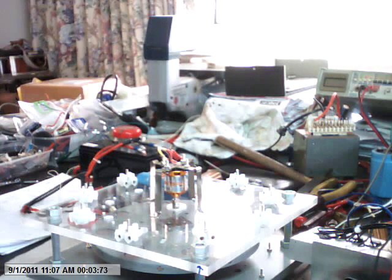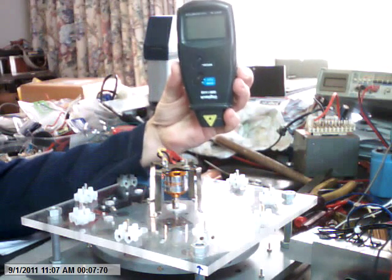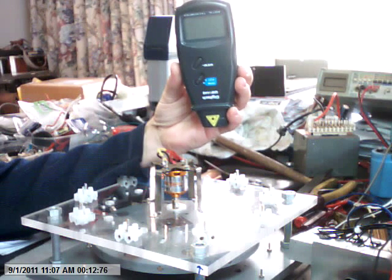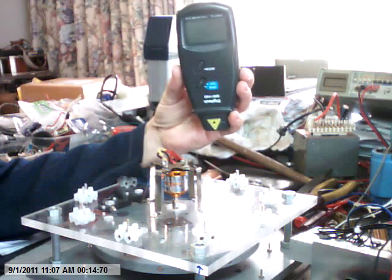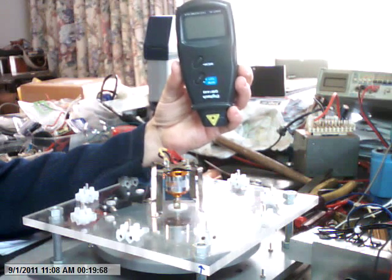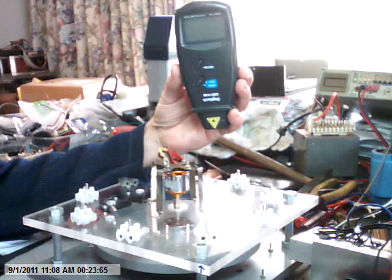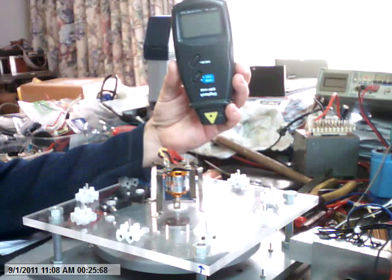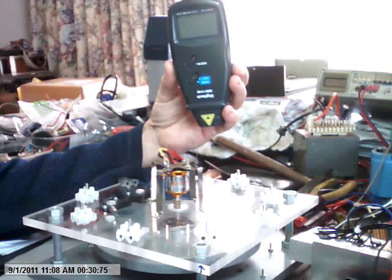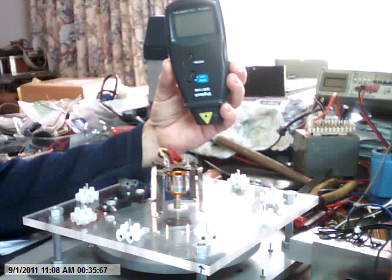Hello, I said I was going to make a quick video of my Muller motor being driven by a model aircraft outrunner motor. It's a small little motor and it's been running off a 12 volt power source. I've had some trouble with vibration but I think I've got that all sorted out. I had to make up some really good shafts because it's a direct drive coupling. I did away with that universal joint and I've gone for a direct shaft, so it was necessary to machine something up.